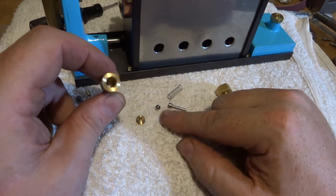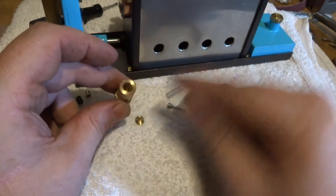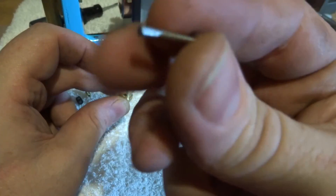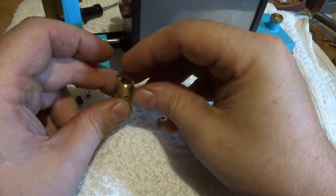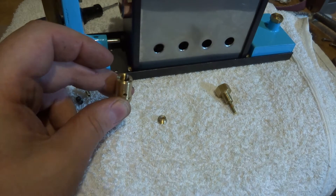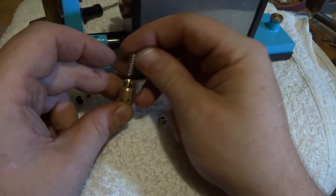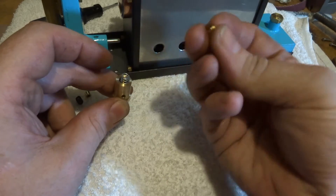There's a 3/16 ball - I hope I don't lose it, I only got one stainless steel 3/16 ball - and there are holes in the side for the steam to get out. That just drops in there. We've threaded a fine thread through the top and made this little piece which has got a spot drill in the top, of a diameter to go through the bush nicely. That sits down on top of the ball. Then there's a spring - it says 22 gauge which is 25 thou wire, that's about what that is - so we might try it and might have to shorten it up after testing.